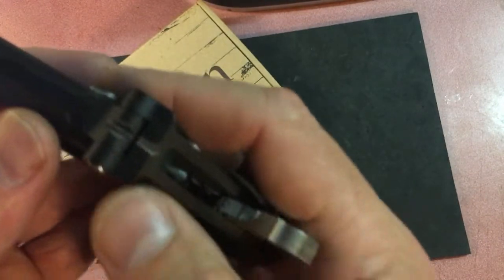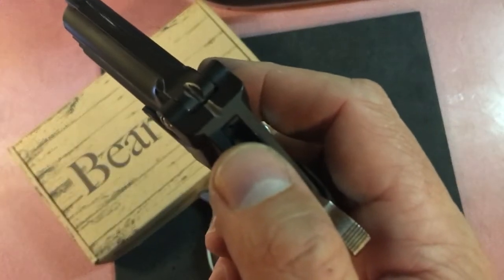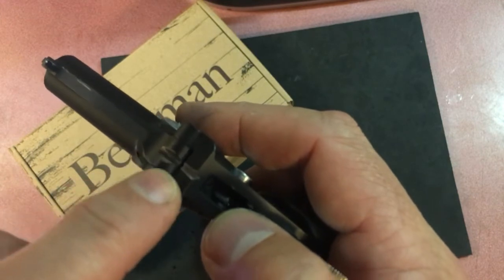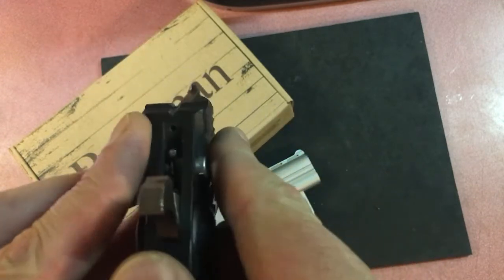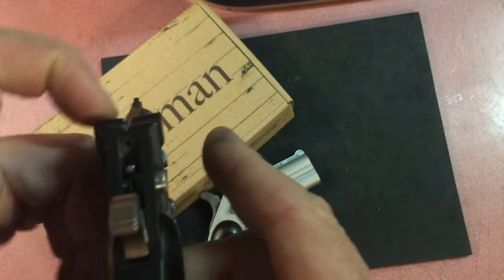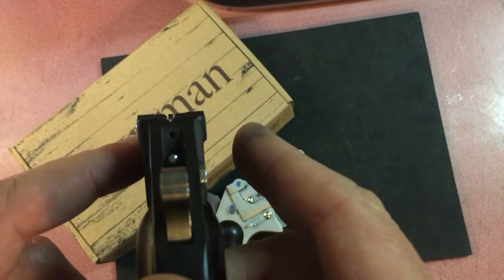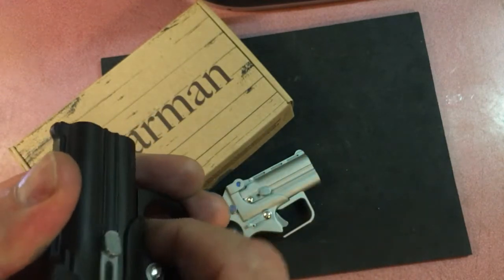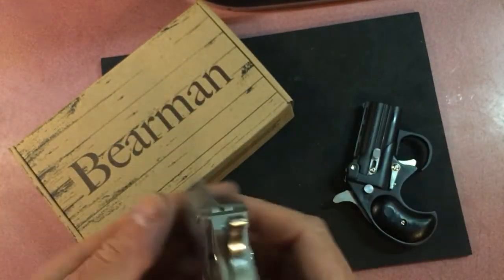You can do your windage side to side filing as well and it seemed to work on this. If you look closely — it might be hard to see — that slot put in at the factory is actually hindered by a piece of the receiver. When you're looking through, you're actually looking over the piece of the receiver and not even seeing the slot; it sits above it. So we just cut into it to put it level, and I think that's about the best it's going to get. If you don't want to cut your gun, then don't — it's a soft alloy and cuts rather easily with a file.